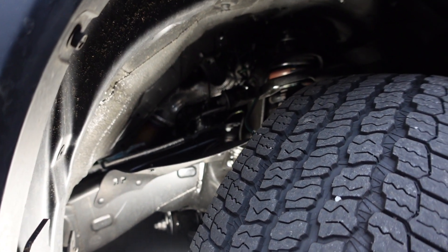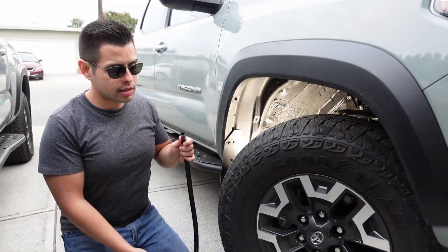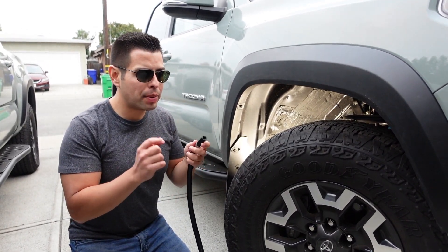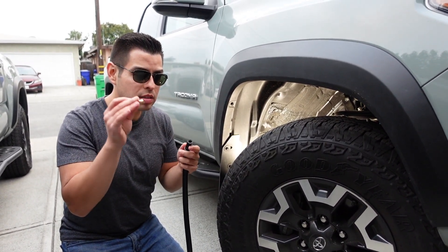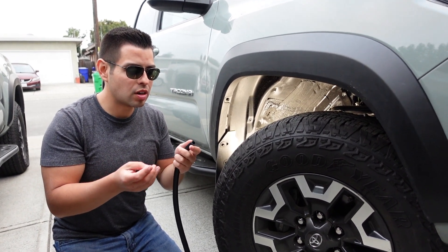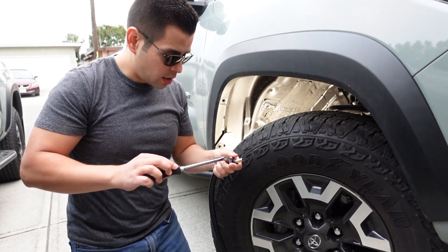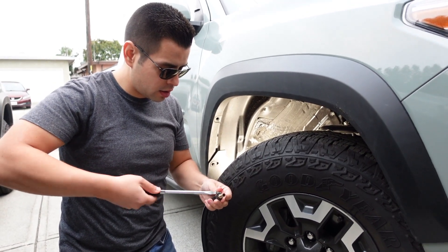Now let me show you how I'm going to attach everything. You can see the hose right there — we're going to extend it. First, take one clamp and put it on. Some people prefer to get a bigger hose and put it over the smaller one, but I don't like doing that. Using a barb fitting is a bit more professional as opposed to just putting a soft tube on top of another soft tube. Go ahead and stick the barb in there, put the clamp on, and tighten it down so it doesn't pop off.